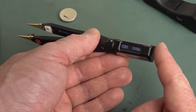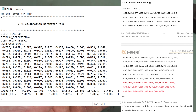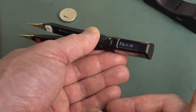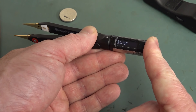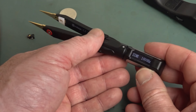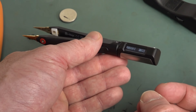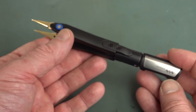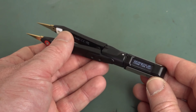Apart from some marketing wankery on the brochure, it does have an arbitrary waveform which you can actually edit when you hook this up to the PC — up to 100 points in a text file, which is quite neat. To get out of calibration mode back, you hold down the button and you're in M for manual mode. Hold it down and you're in identify with A for auto mode. Hold it down again and you're in SIGGEN setup. It's fairly intuitive to use the button on the back. It is basically a capacitive touch sensor. The probes have polarity — red is positive, blue is negative — and you can actually replace the tips by unscrewing them.